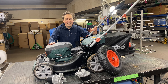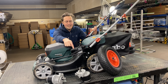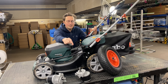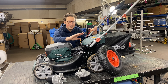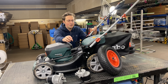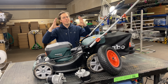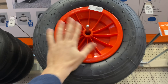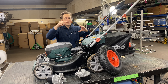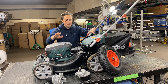I had this idea when I was a little kid and now I'm finally doing it. So I bought these two wheelchair motors and they have a lot of torque. They're quite slow because they are geared and they have a long shaft so I can attach the wheels to them directly without having to need any more gearbox or bearings. For the wheels I'm using these wheelbarrow wheels because they have a bigger diameter and they're also filled with air so I can adjust the tire pressure to get good grip, and with the certain diameter we get a good speed because I don't want it to be too slow.